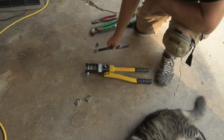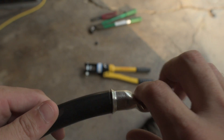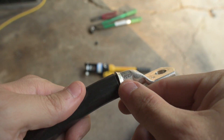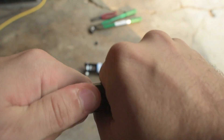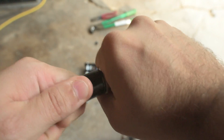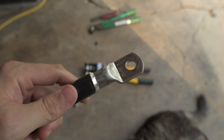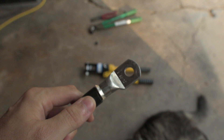See if I can get a close up of that — there's your crimp. I don't know if this is a great crimp or a poor crimp. When I tug on the cables, sometimes that gap gets a little bit bigger, but I think that's just the insulation moving. Usually if you wiggle it, bad crimps get worse. I think it's probably just the insulation moving, so I think that's a pretty good crimp — but we're going to cut it on the bandsaw to find out.